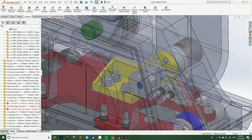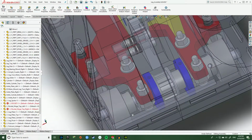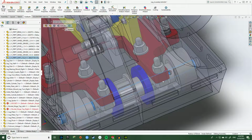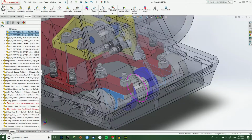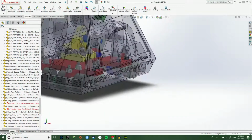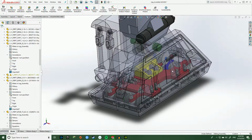There will be a small belt that will connect from the motor to the actual drive shaft. The drive shaft has a series of wheels that will be set screwed into a shaft right here. These drive wheels are able to be set screwed into this drive shaft here, so we're actually able to get power into the wheels. To keep the drive shaft level, we have these two mounted bearings on both sides right here that allow the shaft to remain level as there is power being delivered into the drive wheels. Now on the other side here are just 4 rubber wheels that are basically just freely rotating with a series of mounted bearings here to keep the drive shaft level. So from a high level perspective, this is more or less how the drivetrain for R2's legs work.